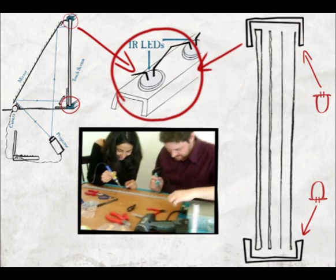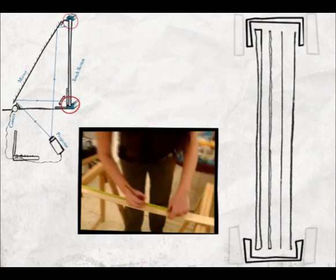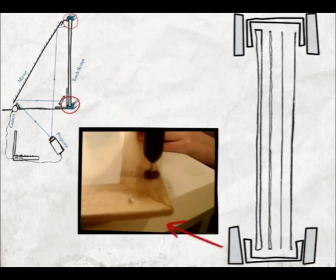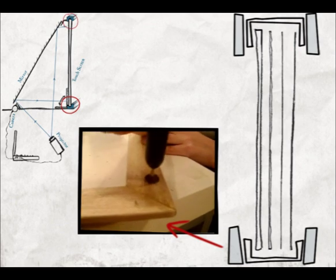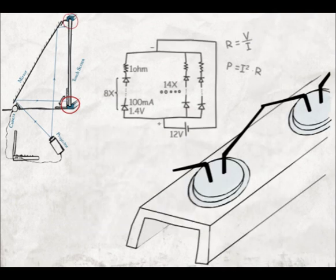The entire surface is surrounded with an aluminum frame which has 112 infrared LEDs drilled into it. To keep everything together and protected from short circuits, a wooden frame is applied around the screen. The infrared LEDs are connected along 14 parallel sub-circuits, each containing eight LEDs and one resistor. The circuit is powered by a standard PC power supplier.